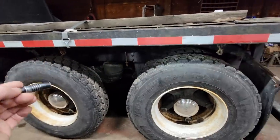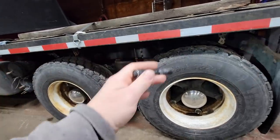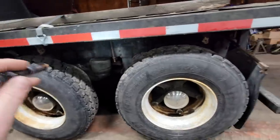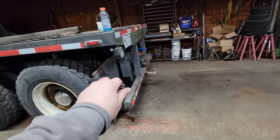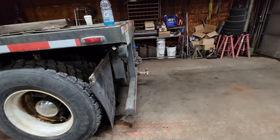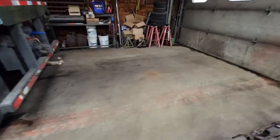After we're done with this, we're going to bring the other one in. We're going to tear it all down back to what this was before that guy touched it, and we'll start over. So what we have to do here is we're putting a tank on this. The tank itself is 20 feet long. We have 12 foot to the back of this frame, so I need to add 10 feet of frame for the tank itself, and then there's 2 foot of where the equipment goes, so that won't be a concern as far as weight goes.